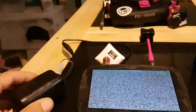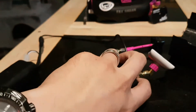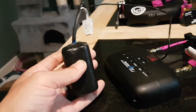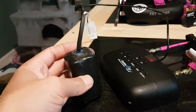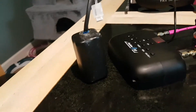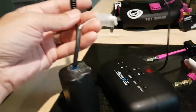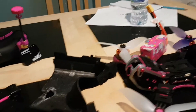The only other plans I really have for this is there's a bit of spare space in here. Instead of running it from a homemade pack I made — that's four 18650s running in parallel series, so it's 7.2 volts or 8.4 volts fully charged — I don't really want to have to run it off these, because I've got loads of proper lipos.